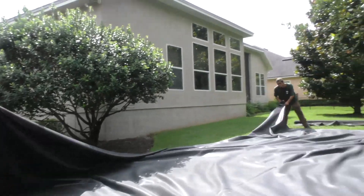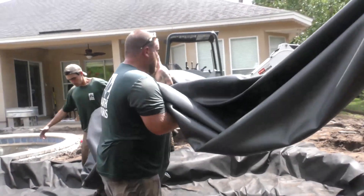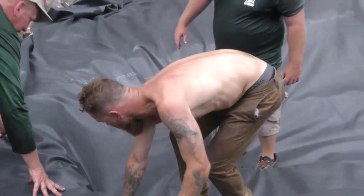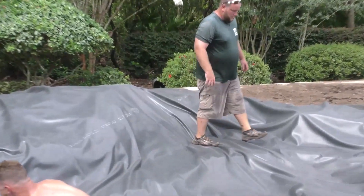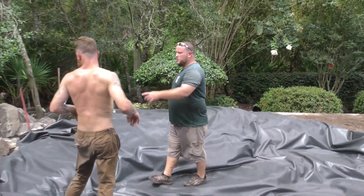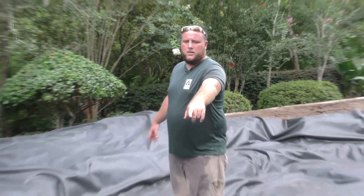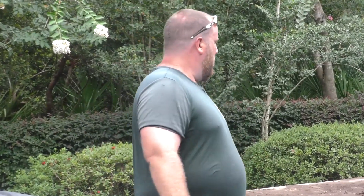Fold the liner in half and then crunch it up. You always want to start from the bottom, get that worked out and then work your way up. As you can see, we've got our liner in now. Underneath here we have our underlayment — you can actually see a corner of it over here. The underlayment basically protects the liner from any kind of roots that will grow in here. The roots will grow to that underlayment and then grow along it instead of going through the liner. It gives a little buffer underneath the liner as well. I have one of our guys cutting little rock pads — for any rocks that are sharper, I'll put rock pads underneath to give a little buffer on top of that liner. We're about to start setting rocks now.